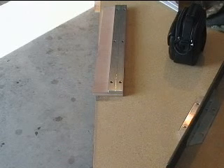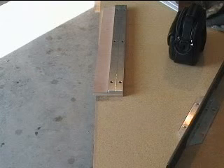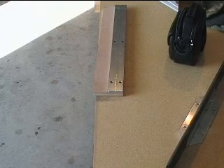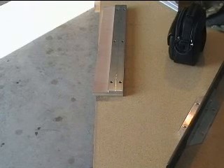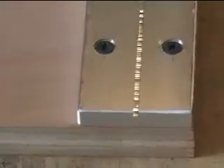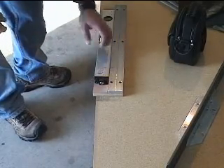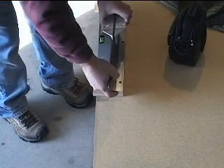I've made a jig to help me align the runners correctly. There is a possibility that the edge touching the ice may not be exactly parallel with the side of the runner, so I've made these jigs that have a small groove down the center that you insert the runner into. The laser level just nests right here up against the side of this aluminum bar with the groove in it, and the runner index is right in here.